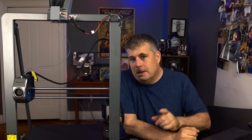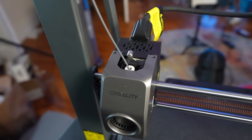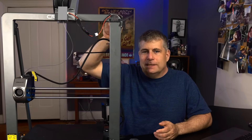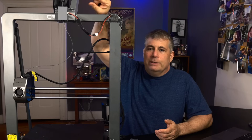Link to the STL file is down in the description. I also removed all of the PTFE tubing so my filament runs directly from the spool to the extruder without any friction. The filament holder moves back and forth while the printer prints, but next I'm going to make a holder for an arm that rotates — like the one on the Neptune series and other printers — so that the run-out sensor can move back and forth with the printhead. Now I've got a tweaked Ender that works exactly how I want it to.